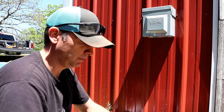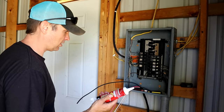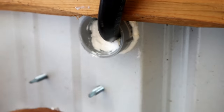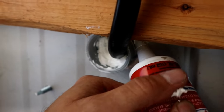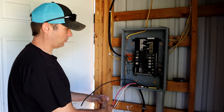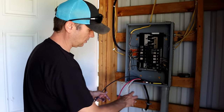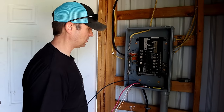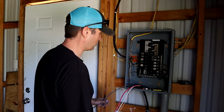We're going to go inside and finish the connections and then seal the hole. This is all the silicone I have with me right now, but I'm just going to seal up this hole here. This is pretty much just going to seal any water or critters out. You could certainly choose to run liquid tight all the way to your box, or come underneath the outside box and put some conduit in. I just figured this was a quick, easy way for us to do it. We don't need to get it inspected around here, so that works for me.